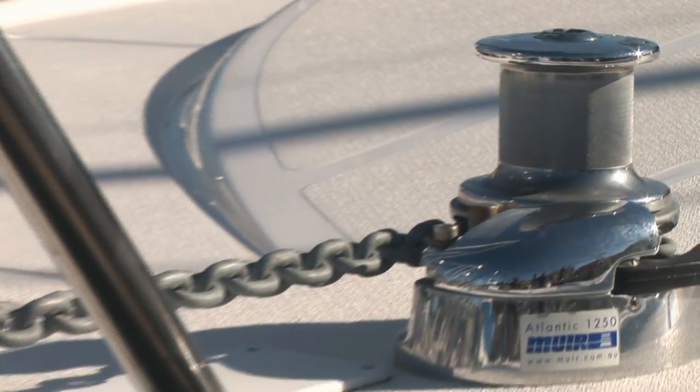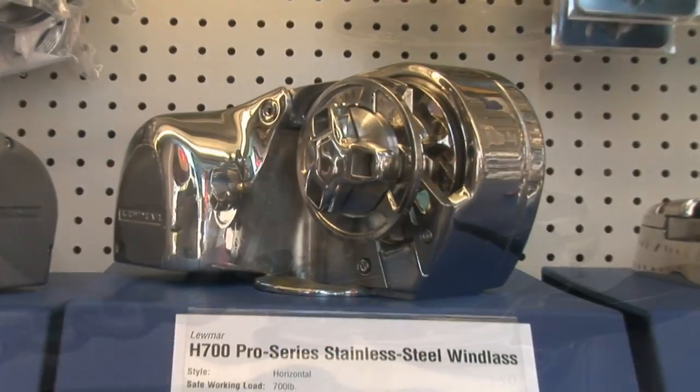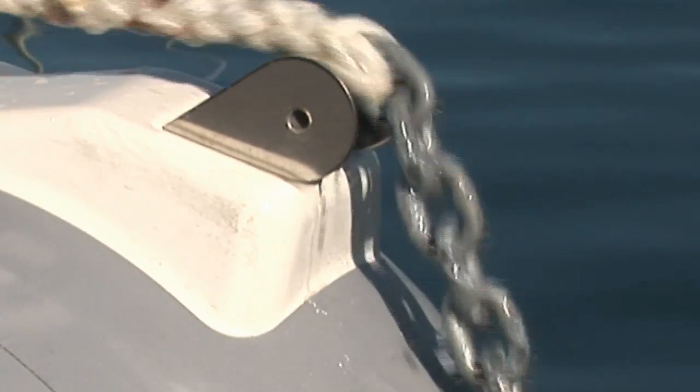However, about 25 years ago, a windlass manufacturer came up with a combination rope-chain gypsy that allows you to pull the anchor rode in one continuous operation. So Chuck, the trick is that you have to make a splice between the chain and the line that will pass around the gypsy. Now here's an area where you have 3 choices.